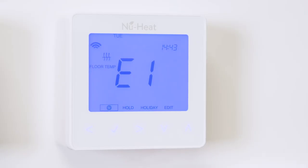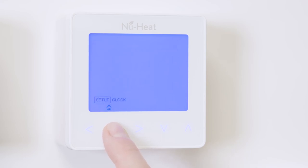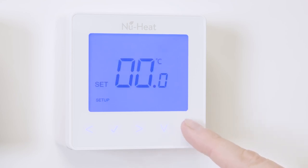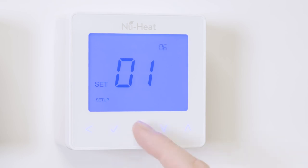To clear sensor errors, check the sensor selection in the settings menu. Use the arrow keys to scroll to the power icon, press and hold the tick for three seconds, and setup will be highlighted. Press the tick — the display will show one in the top right-hand corner. Press the up or down key so that six is shown as the smaller feature number. Use the arrow keys to change the sensor selection: 00 is the default internal sensor, 01 is the remote air sensor, 03 is the internal air sensor and floor sensor, and 04 is where you have both a remote air sensor and a floor sensor. Press the tick once you're happy with the selection and the error will clear.